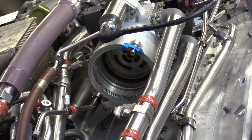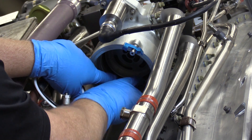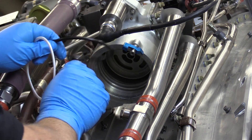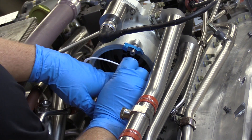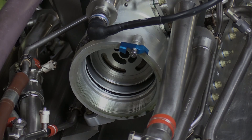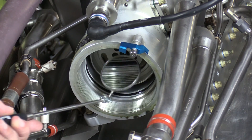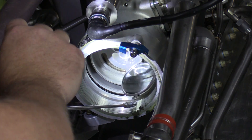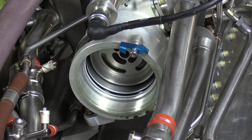We are going to assemble the filter assembly. We have our new O-ring and our two new Teflon rings to install in the housing. We will first install the upper backup ring, then install the packing in the groove, and then install the lower backup ring. We want to use an inspection mirror and verify that we have those installed properly in the groove inside of the filter housing — and it looks like we do. So now we can continue on with the installation.